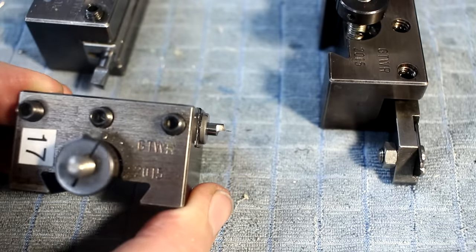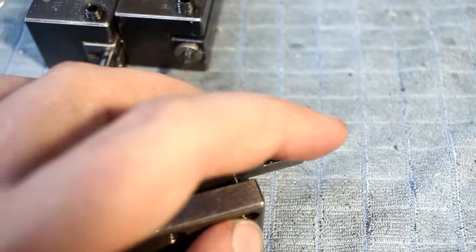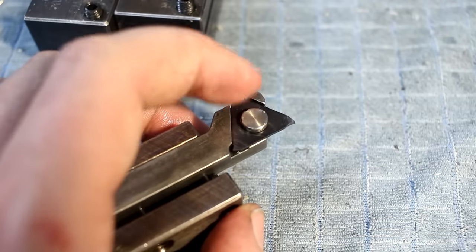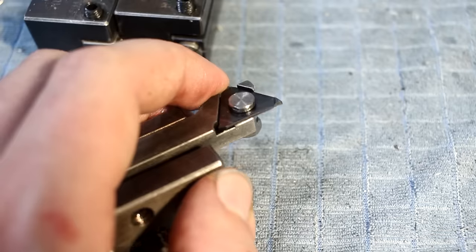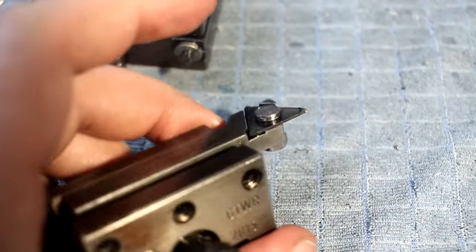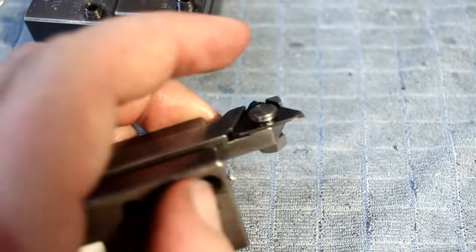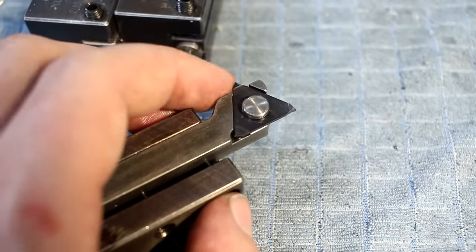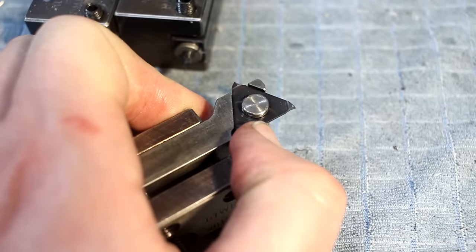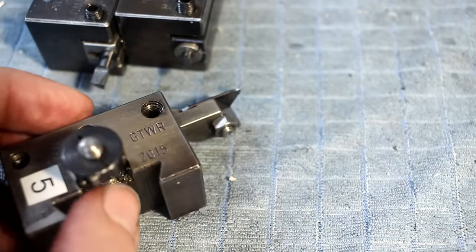This is ground on the big grinder. The parting tool I use, these triangular inserts, these are Paul Horn. I'm using these because I got about 100 of them from a viewer sent to me, used ones, and you can grind and regrind and reshape them a million times before they are completely gone. Works quite well. I made the holder myself. It has just this shape milled into it and has a through bolt with a nut on the side holding the insert. It's not the ideal design. In reality, a clamp that pushes down from the top on the insert would be better, but it works so far. Used this for maybe 5 years now. Quite nice.